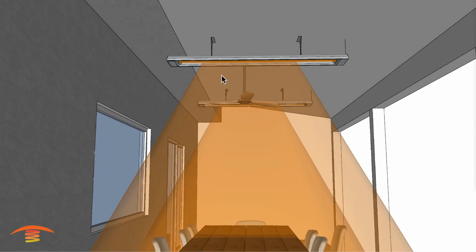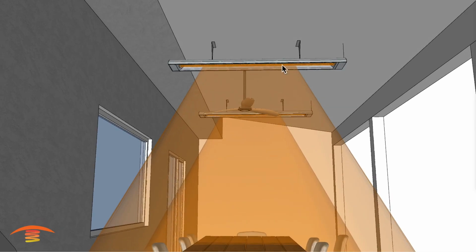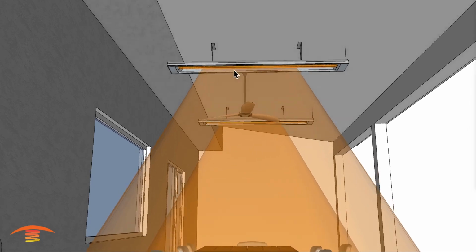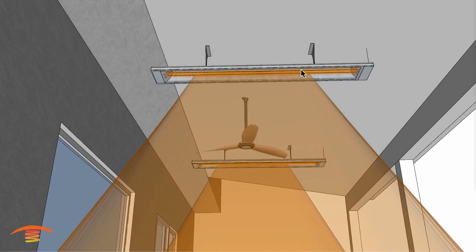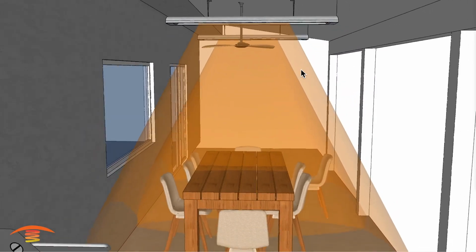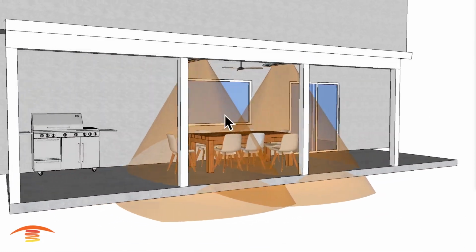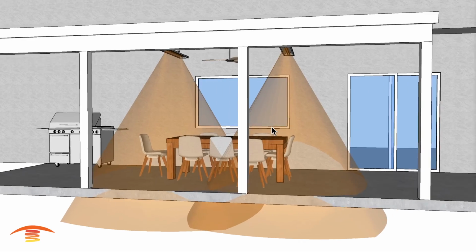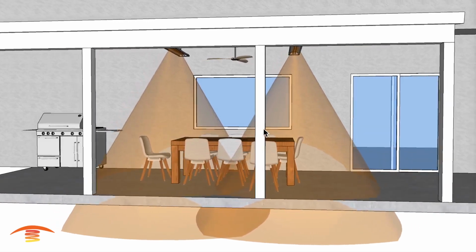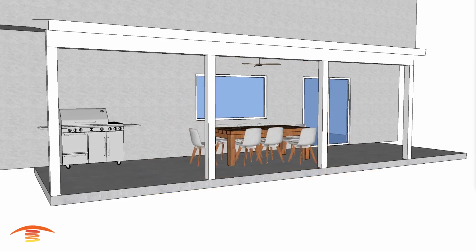This, I believe, is in a colder climate, so you want to make sure that you have this controlled at some point using a duplex switch, meaning that you can turn one element on, one element off. May or may not be sufficient for the application, so I'd probably recommend, if you're going to use 6,000 watt units, to go ahead with a control system. Otherwise, consider using the 4,000 watt units. So let's go ahead and turn that off and look at another option.